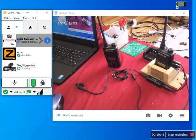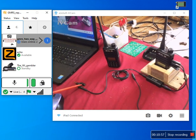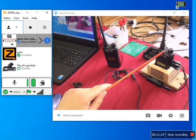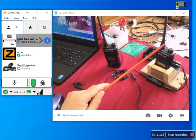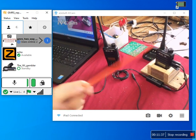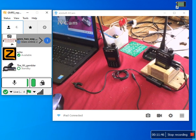Those are the two main things you need to do. I'll post the links to the ground isolator and the adapter in the description below — the adapter will be a cable type, not a hard one like this. Make sure you've got the VOX setting turned on in the radio and the VOX sensitivity all the way up. There's also a timeout in the menu — if you key up this radio and hold it keyed up, it will timeout. You can turn that on and off; I turn it off so I'm not going to worry about it cutting off. Hopefully this will help explain everything. If you have any questions or comments, please post them down below. Thank you and have a good day.